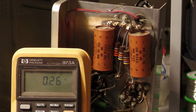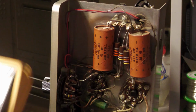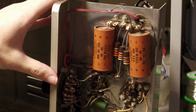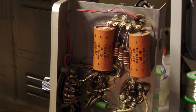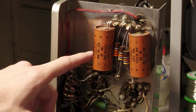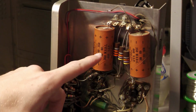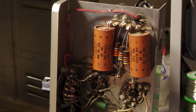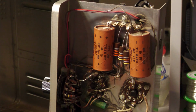Now how can we measure this leakage? Actually with a meter like this, which I currently repair, which is this leakage meter. So now let me show you how leaky these capacitors actually are. So let me show you if I'm right with my assumption that this reading of more than 80 microfarad means that this thing is leaky. So let me configure a little test setup for this, and let me show you how this is.